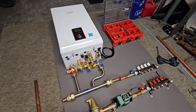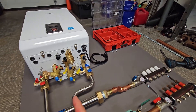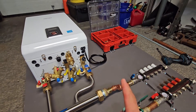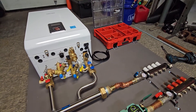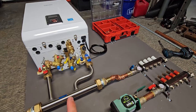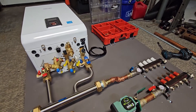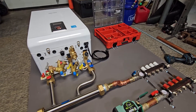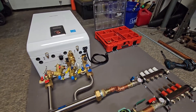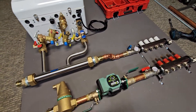To get into that a little bit — these boilers come in many different sizes. The combis come anywhere from 60,000 BTUs all the way up to 200,000 BTUs. There are some larger ones in the commercial sizes, but generally that's it. All the time I see people with a 200,000 BTU boiler when their home may only need 60, 80, or 100,000 BTUs. They're purchasing something up front that they will never utilize to its full output. Anytime I can help somebody save money and possibly upgrade to something like a more efficient circulator, I'm going to recommend those things.